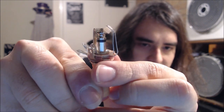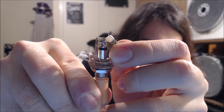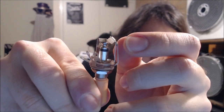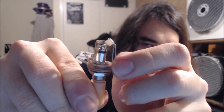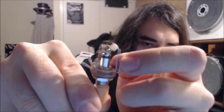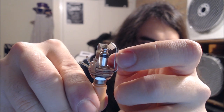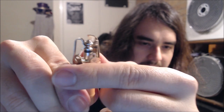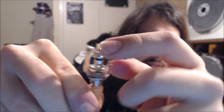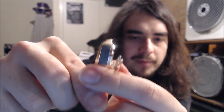You see that little white plastic bit at the top? It pushes this bit back and it connects these two plates. What that does is it connects both separate pickups. You'd have them attached separately from each pickup into either one of these plates. And once these two are connected together, only then is the signal connected to this main tip piece in the mono jack, and it goes out into your amp and you get the signal from both pickups.